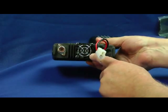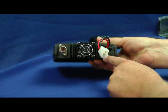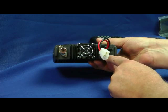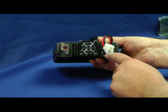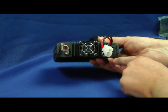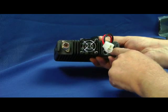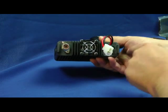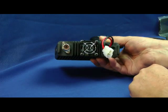Here's the fan to keep things cool, the antenna connection, and a data jack. That data jack is for an external TNC. This is set up for APRS with an internal modem TNC, but if you want to do other packet, you'll have to use an external TNC. Here is also the speaker jack, which is stereo — it does come with an adapter for a mono jack.